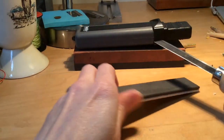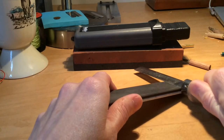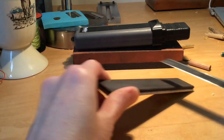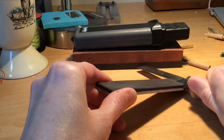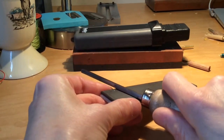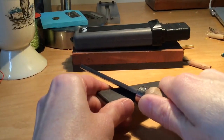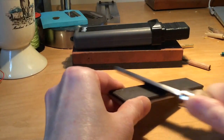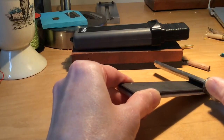Okay, three-step sharpening process. My first step is I'm going to lay the knife with my scraping edge face down. I'm going to lay it flat on the stone and then raise it to about a 10-degree angle — not a very big one — and I'm going to bring it back once or twice. You can see that I'm diagonaling that blade across the stone, and that's just to make sure that all of the blade gets covered with every stroke. Once I've done that, I'll flip it over so that the scraping edge is on top and I'll raise it to about a 40-degree angle — 35, 40, not quite 45. And at this point, this is my main sharpening stroke, and I'm just going to pull it with a fair amount of pressure, backward and forward — it doesn't matter — just so I maintain that exact 40-degree angle between the knife and the stone.